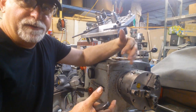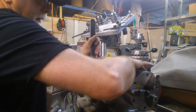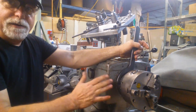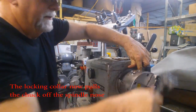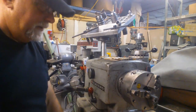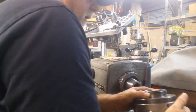I'll show you what I'm talking about — it's actually what I call seating the chuck. Once we get past that initial loosening, we're getting that second bit of resistance, so we're going to hit it again. This is going to pop the chuck off the spindle. Now the chuck — I don't know if you saw it drop a little bit there — it's now loose. So there we have our chuck.